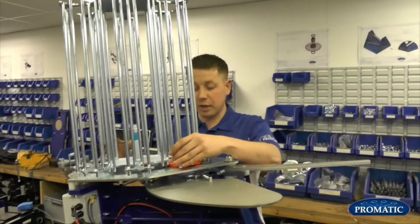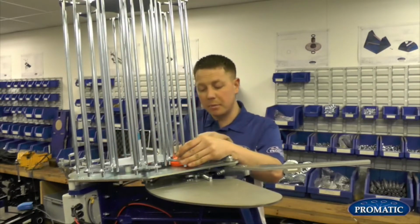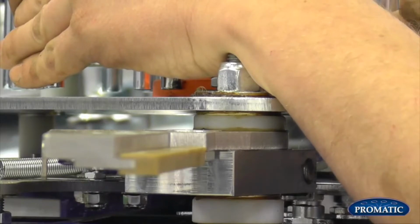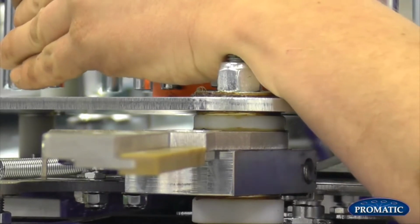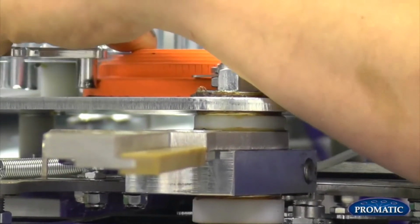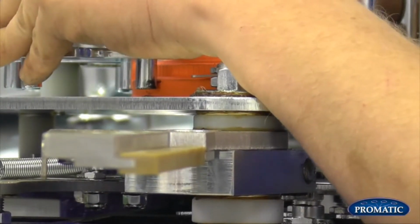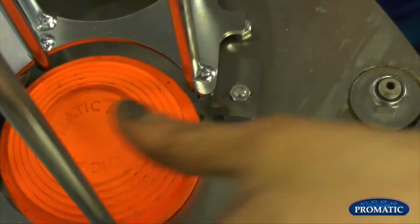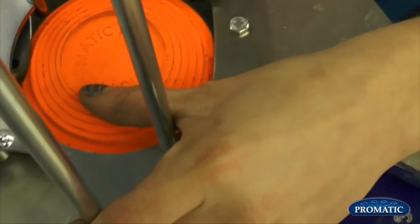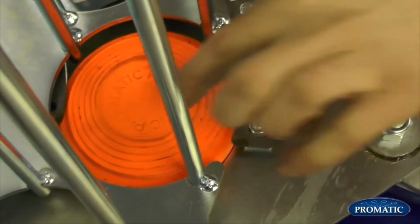We're looking for a couple of millimetres from the drive band of the clay, front and back. If we can achieve that and get the knife edges passing through there, the clay passing through the knife edges without it coming into contact, we know we've set our knife edges correctly. When we come to set the knife edges, as we bring the clay in there now, what we're looking for is an equal gap front and back.